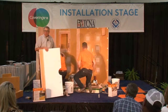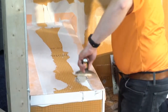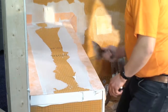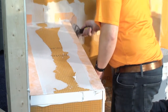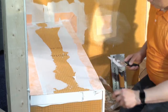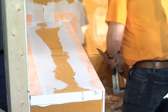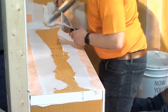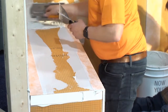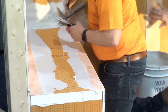We're showing that we've recessed the floor in this shower area where the shower pan's going to be by 3/4 of an inch. So you can imagine if you had standard 3/4 inch subfloor, plywood or OSB, we're showing OSB here, and you took the subfloor out from on top of the studs and then cut it in strips and had it down recessed to be even with the top of your joists or flanges instead of sitting on top, you just gained that 3/4 of an inch. That 3/4 plus the thickness of our DITRA heat, or our DITRA XL for that matter, abutted to it is going to give you a flush access right off of your bathroom floor right into your shower. So you now have that curbless shower with no speed bump, no bump up and over, it's just going to go flush straight in from that floor.